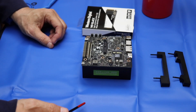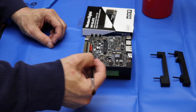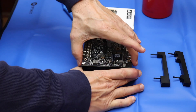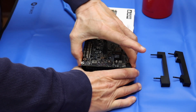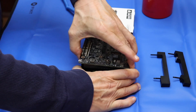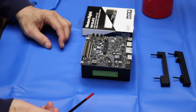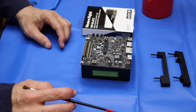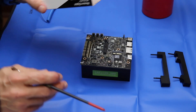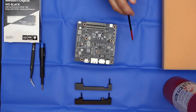There is a 699-pin connector holding the module to the carrier board, located right here, so we will carefully disconnect it. We need to be careful when we detach it — there is a wire that goes from the module to the carrier board which controls the fan. It's very delicate, so we want to be careful. Move this out of the way for a moment. The wire is not long enough to reach from the top of the Jetson module to the surface of the table.